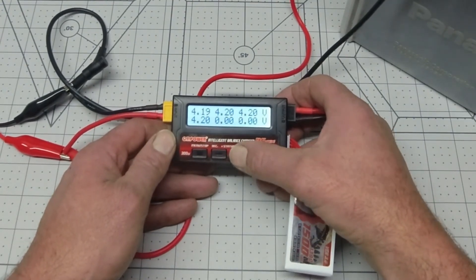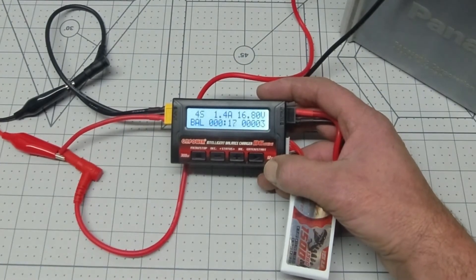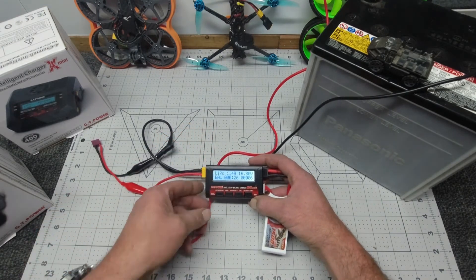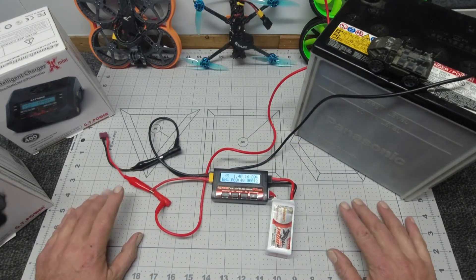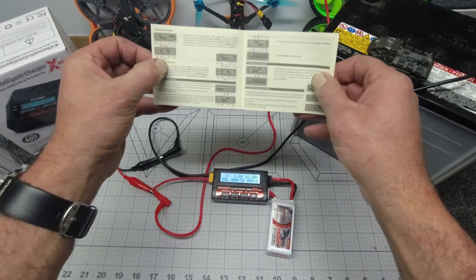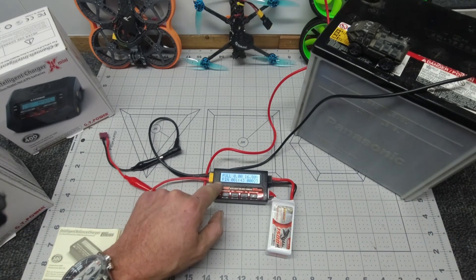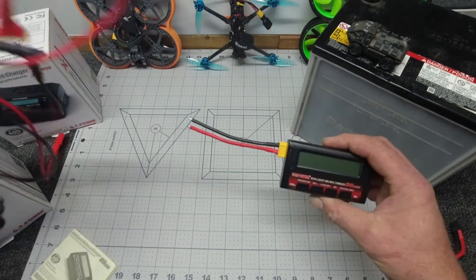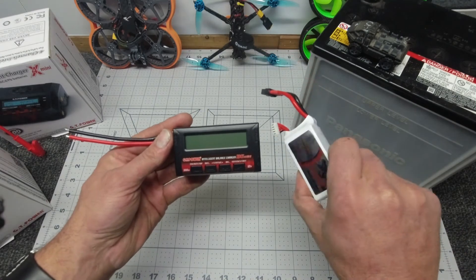Now you can just hit the positive increment and it will tell you the voltage of each cell. Press it again and it will tell you how much fuel is in the battery after a few moments, and the cell voltage as well. This battery is fairly full so I expect it's going to beep at me and tell me it's fully charged. And there we have it — full, finished alarm. We hit stop and turn it off. What a fabulous little charger to take away with you — just take a cigarette lighter adapter, adapt the end however you like for your input, and that is all you need to get yourself charged out in the field.